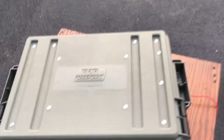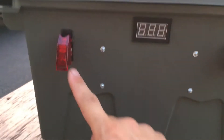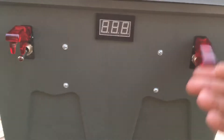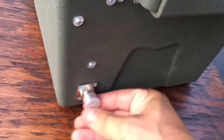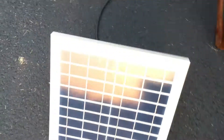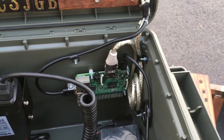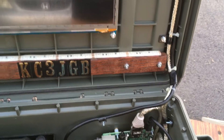You're looking at a homemade ham radio go box with a toggle switch here, toggle switch here, voltmeter here, and antenna connection. Nothing on the back — we have a 12-volt plug here for my solar panel, that's 15 watts for now. Inside we have a seven-inch touchscreen hooked up to a Raspberry Pi 3, running the Jessie image with G-Predict so I can work satellites with my Arrow antenna and portable handheld radio.